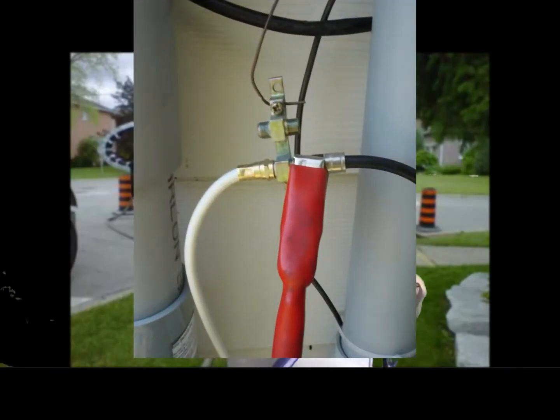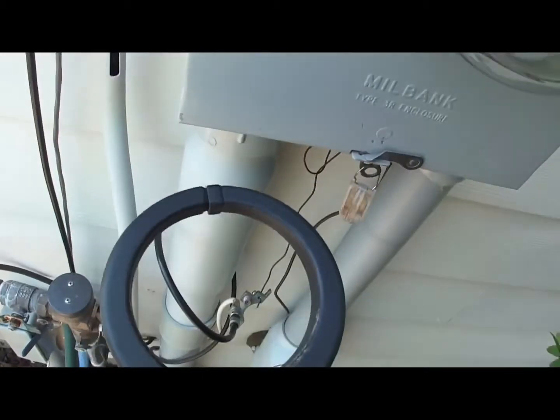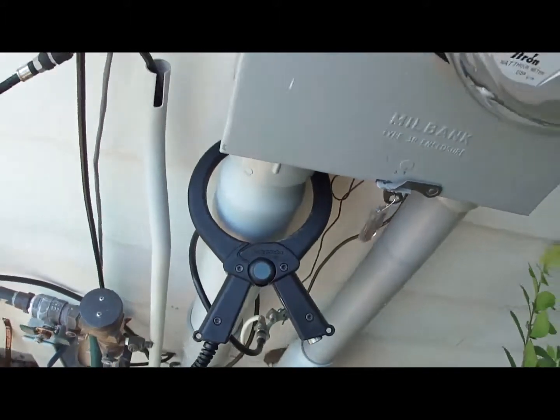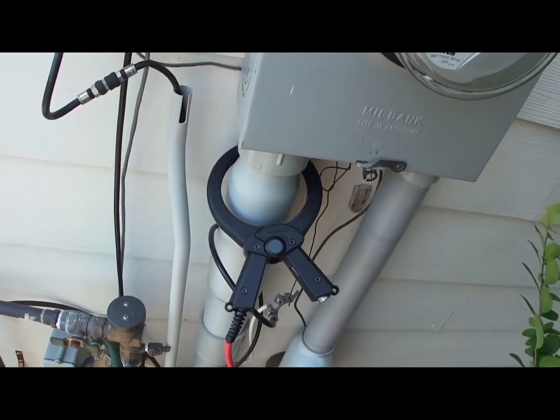Signal can be placed onto the line with direct connect leads, inductively by placing the transmitter over the top of the line, or with an optional ring clamp. The optional ring clamp is sold in a 2-inch, 4-inch, and 8.5-inch version. This helps in areas where you have no access to the wire.